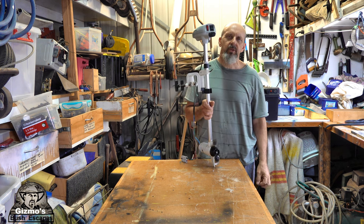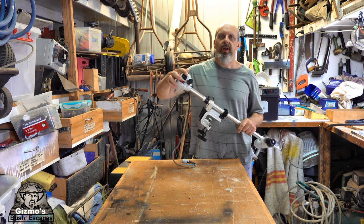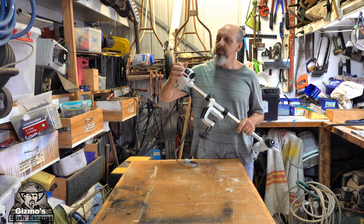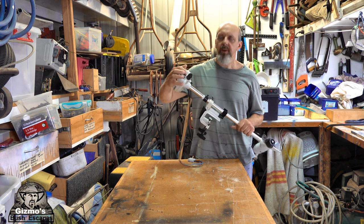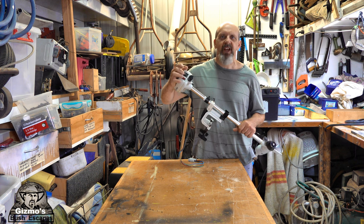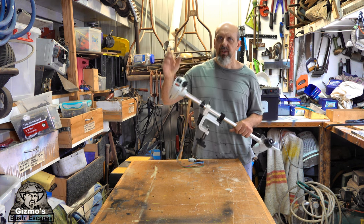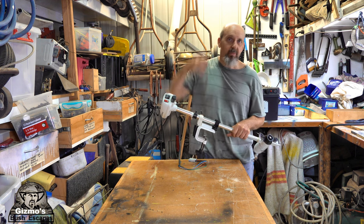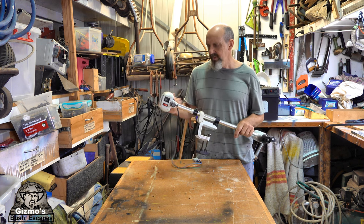One of the switches was actually shorting out a little bit. I replaced one of these switches not long ago, the big double one, because the older one started to corrode as well, and I bought an exact copy from somewhere on eBay, but it possibly might not carry the same amount of amps, and it's a bit dodgy and sticky, so that's also an issue. It's not the issue why the motor actually just stopped midstream. That seems more to me like a brush issue.